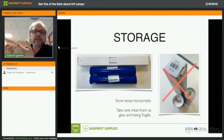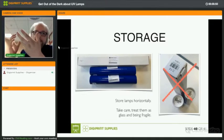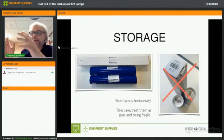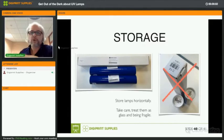That's when you know that you release the mercury, because the mercury stays around the metal halides inside that lamp like that. If it's a pure mercury lamp and you shake it, it's possible that inside the lamp there's like a mist that starts to appear. That's also a sign that the mercury has been released, but it's not always the case.